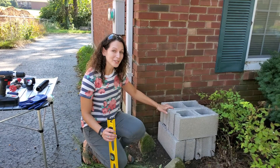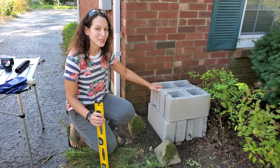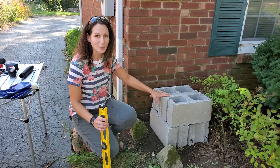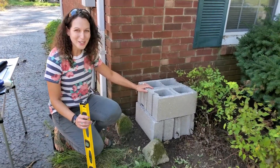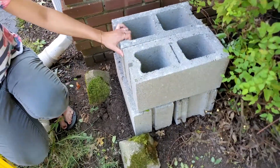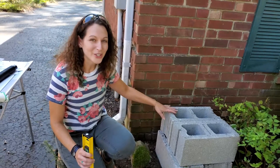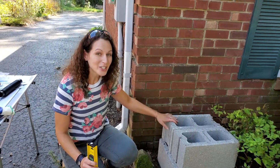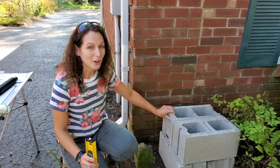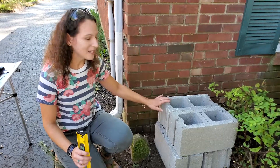Once you decide where on your house you want to install your rain barrel, there are a few important things to keep in mind when prepping your site. If you plan to use a hose on your rain barrel to get the water out, you're not going to have a lot of pressure. I've just used cinder blocks here — you can get these at Home Depot or Lowe's, they're about a dollar each. We want to have a raised platform to keep our rain barrel high up. I've already made sure to level this out. A gallon of water is very heavy, so if you've got a 50-gallon rain barrel that could fall, especially with kids around, we want to make sure our rain barrel is secure.